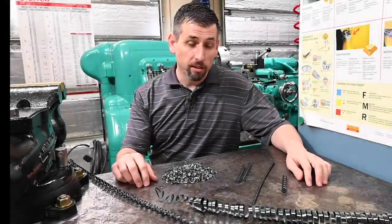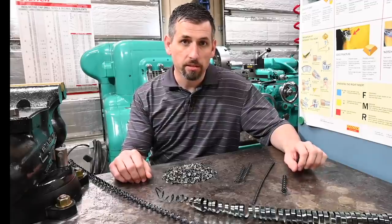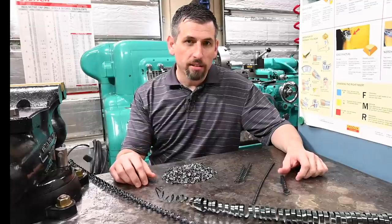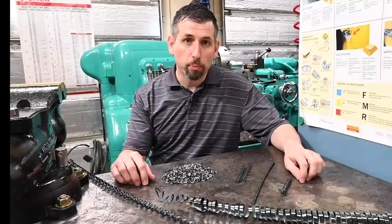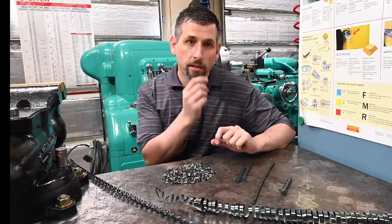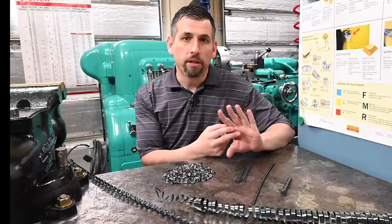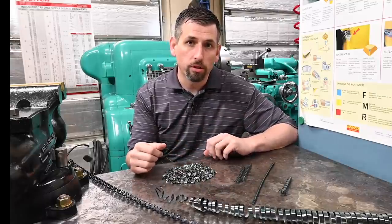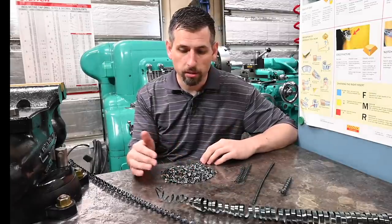Well, that was certainly a learning experience, something I'd never done before, taking big heavy cuts like this in a turning operation, and had a little bit of trouble on the way. So in case it wasn't clear earlier, the tool post was damaged, so the connection between the stud and the nut had failed, and so it was still holding on, but not well enough to be taking those big heavy cuts. So that's why the tool post was turning so badly. And as you can see, as soon as we got that fixed, it was running like no problem.